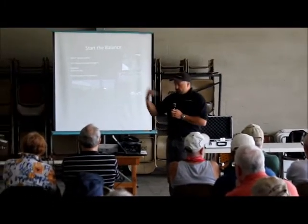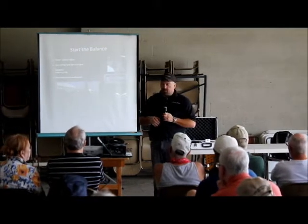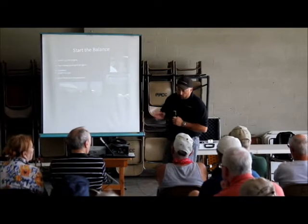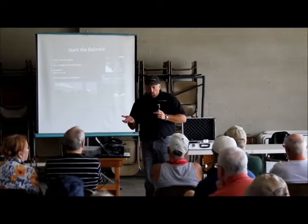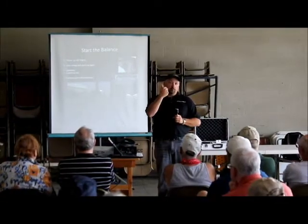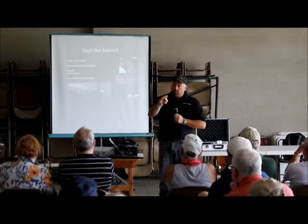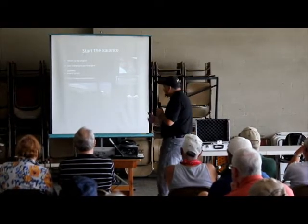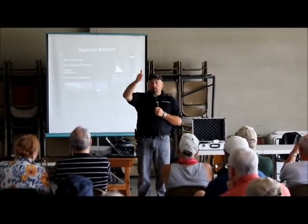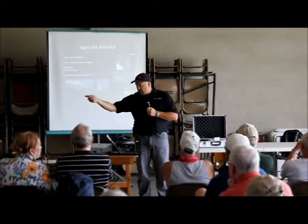After you've averaged, you bring the power back, let it idle, let everything stabilize, then shut down. This is probably the trickiest part. The process is to clock the prop — rotate the propeller until the phototach sees that piece of tape. You rotate the propeller, it sees the piece of tape, and then the accelerometer direction is zero. So normally if you're pointed up, that's zero degrees. In the case of horizontal mounting, that's also zero degrees.